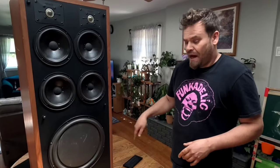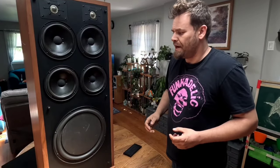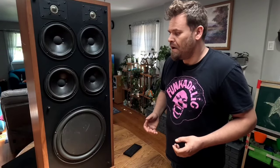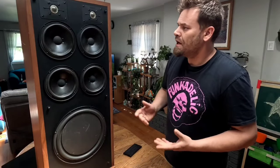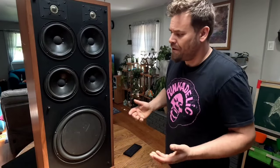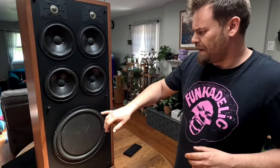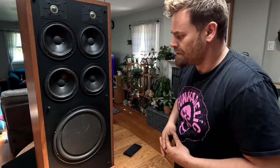I had to lug this thing onto my dining room table because, as you can see, it's pretty gargantuan. I don't know if this is anything I'm going to be able to fix today, but I want to dig into this, see if there's anything going on, see if it's something I can fix right away — or maybe put a new crossover in it. Maybe it's a driver, I'm not sure. It seemed like on the other one that did work, the drivers worked, but I was getting nothing through the crossover. I didn't have an ohmmeter on me at the time, but I've already ohmed it out — either open or just erratic impedance all over the place. So I'm going to probably remove either the back speaker terminal or this passive radiator first, which will give us a look at the inside and the crossover.